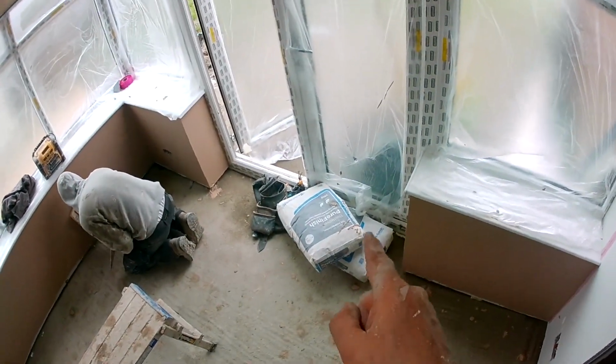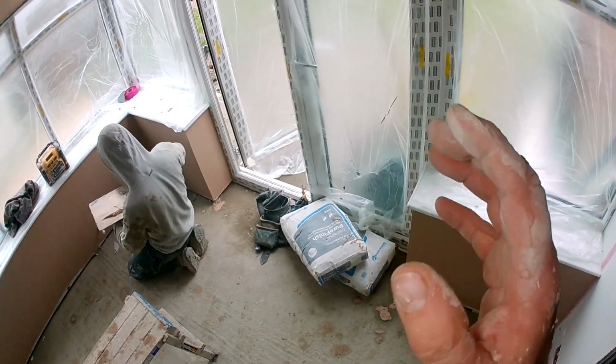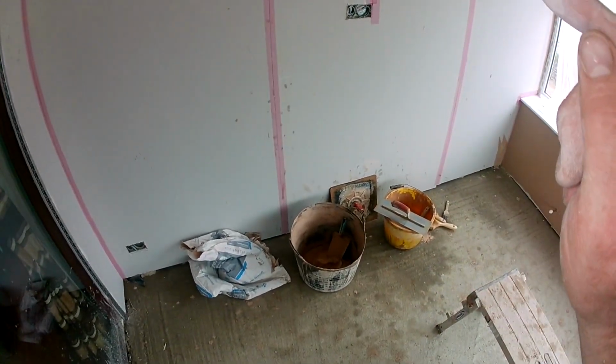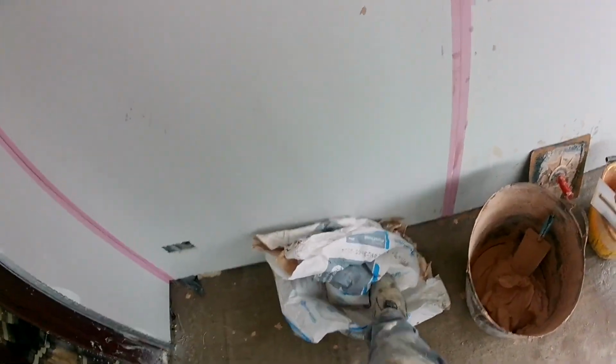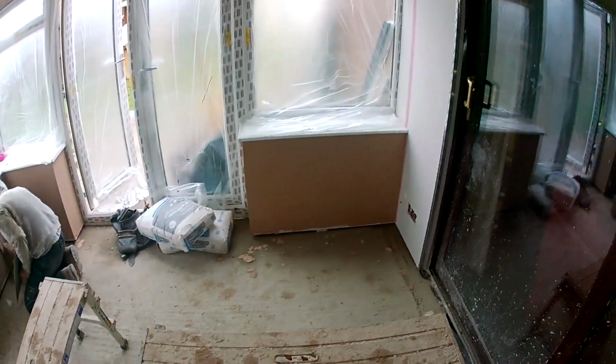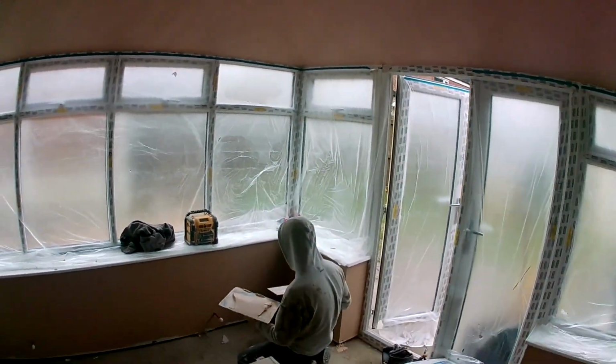I'm not sure, this pure finish sets in about an hour and a half, but you can work it all hour and a half. But it seems to go a bit further because we mixed a bag and a half with some left in the tub. Actually, we didn't mix a bag and a half, we mixed about a bag and a quarter. That's left in the tub, and like I said, we've got these dwarves on as well. So now, we broke its back, easy mix. There's 2 boards on that wall and 3 on that. Well, there's not 3 on that. Bit off that end, but call it 5 boards, a bag. Rackle that on after this mix, and it's home time.